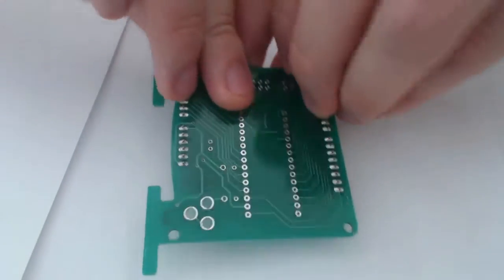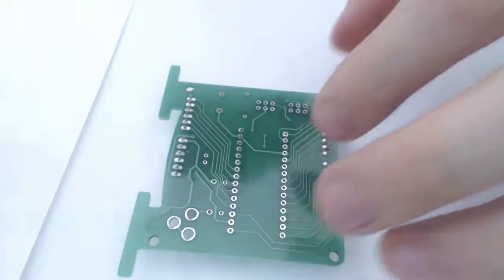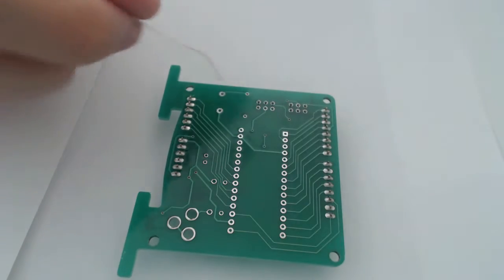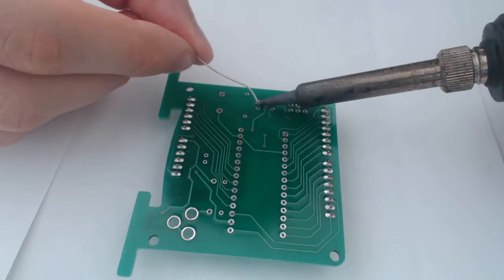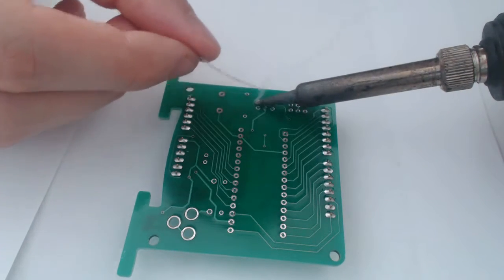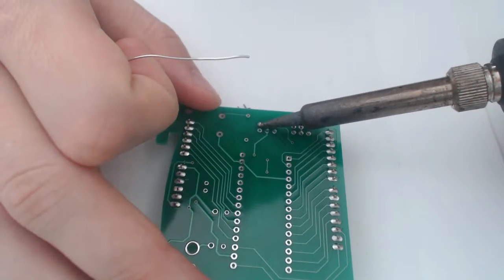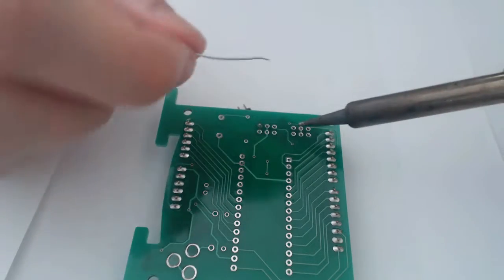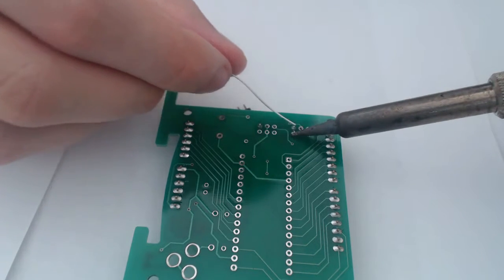And once again, this is how I choose to handle these guys. There are probably easier or better ways to do it. And actually one of the 1x3s fell out, so I'm going to have to solder that guy in separately. Once again, the surface is conducting very well. Uh-oh, he's misaligned, so I'm just going to drag it along the paper while I have the soldering iron touching to keep the solder hot, and that gets him to be realigned.